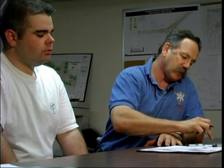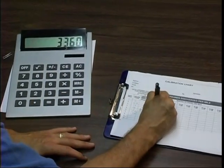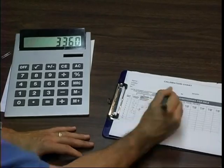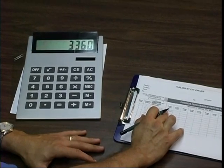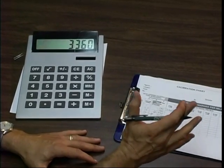Then going 10 miles an hour, it would be multiplied by 6 — so pounds per minute times 6 is 1,680. Then using the pounds per minute again, it's 280 times 4 is 1,120. We'll do a couple of them because it's important — sometimes you go a little bit faster or a little bit slower on your application rate.